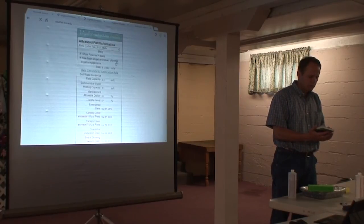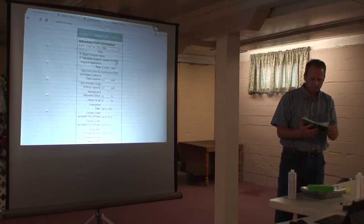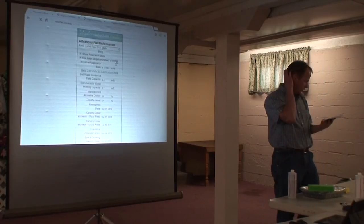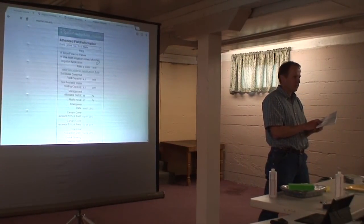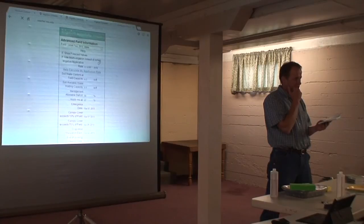But if you don't remember that, there's a formula in this book too. If you go to flows, look on pages 32 and 33, there's some formulas in there where you can put your set time in hours, your flow rate in gallons per minute, and your system efficiency, which for a big gun you should probably use 60%, so that's 60% efficient. Time of day, would it affect it? That's right. It would affect it a little bit, actually.